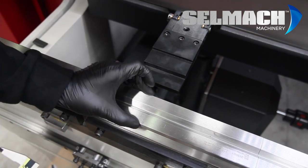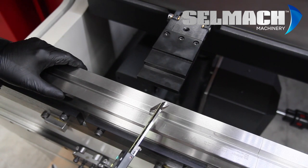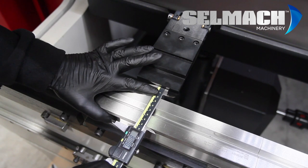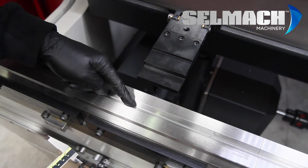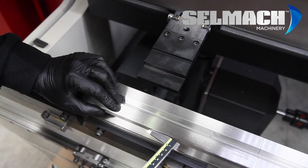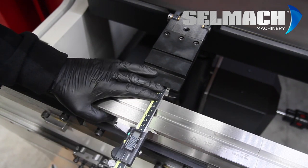The tool is 60mm wide and the distance we programmed was 50mm from there to the probe. We need to measure from the front face rather than the back. It's more difficult to measure from here, so it's 50mm plus 30mm equals 80mm. And as you can see, it is now reading 80mm — confirming the 50mm setting is correct.